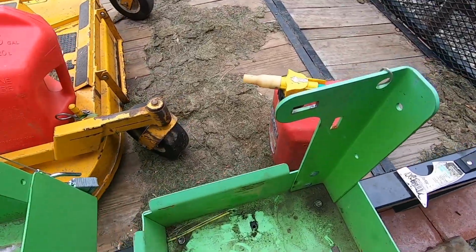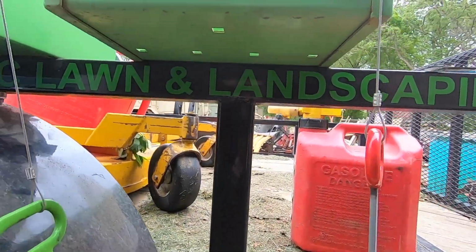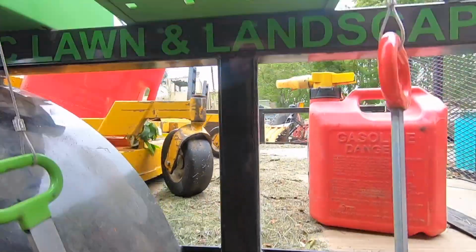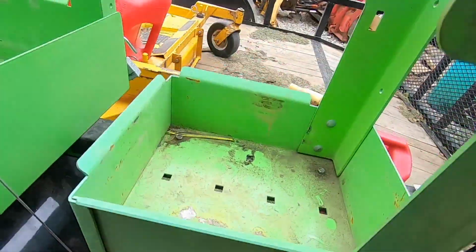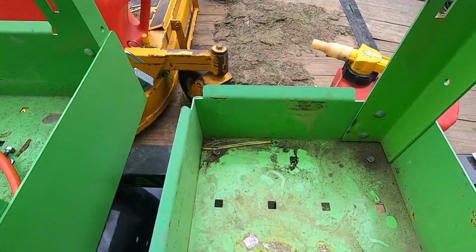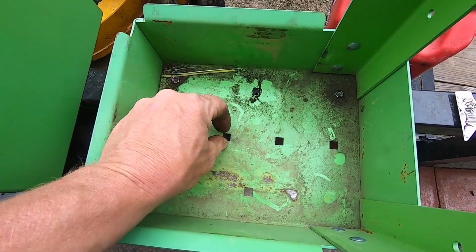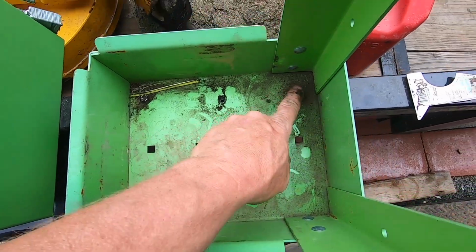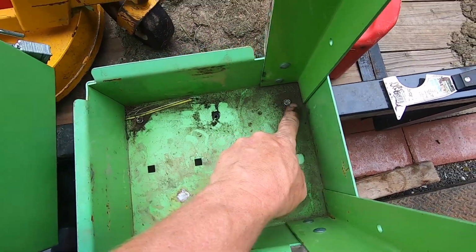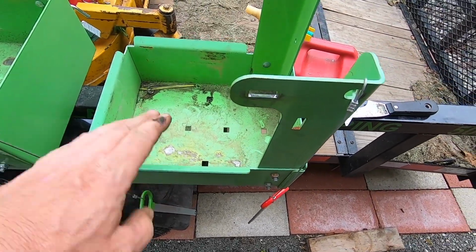I was just about to drill that and realized that's going to land right inside of that upright support, so I won't be able to get the nut on it. And I want to use one of these squares because, as you know, the carriage bolt is kind of retained by that. So what I think I'm going to do then, I made these 2 holes so I could have this out even, almost even with this one.